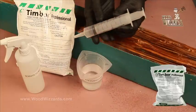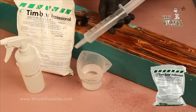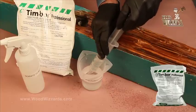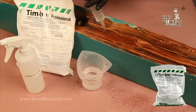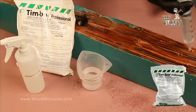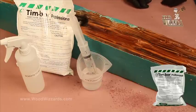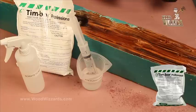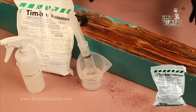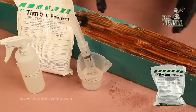This system is so exciting — to be able to take an old piece of wood that you don't have to remove from your house and be able to clean it up and do these processes. What's our next step, Arnie? Next step, we're going to apply the bonding agent. It's a part A and part B mixed in equal parts, and it's going to bond the dough to this existing piece of wood. How long do they have to wait for the borate to dry? Let's give it 15 to 20 minutes at about 70 degrees temperature, just like we did the bio cleaner.